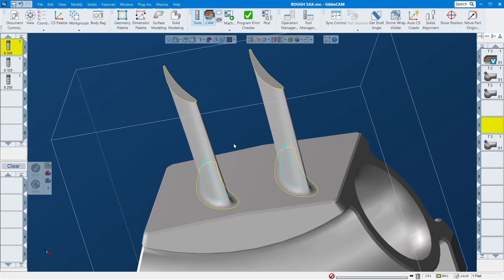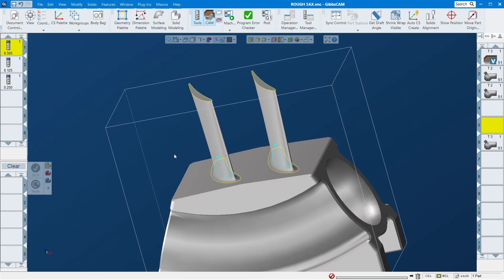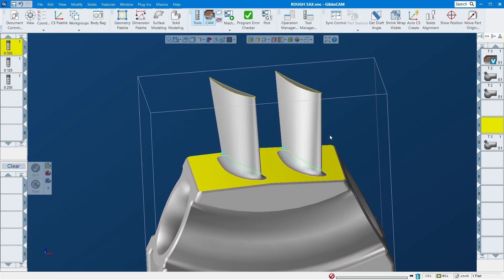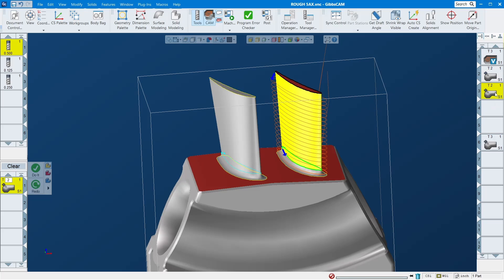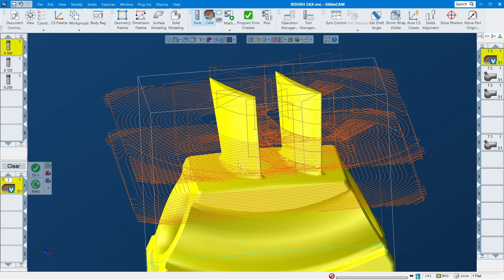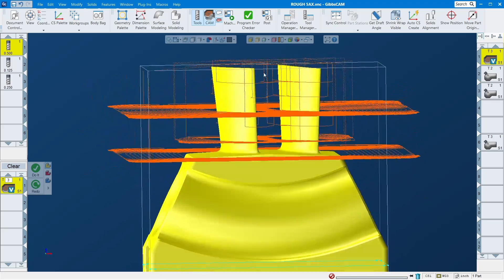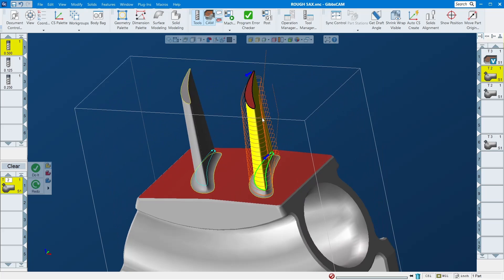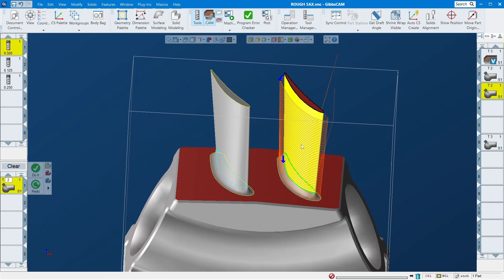For example, with a part like this, I don't usually rough all the material out with five-axis. If you want to finish a tool path and floor like this part, I rough out with three-axis toolpaths and then come back and thin it with a five-axis toolpath. So let me show you — this will be Volumill. You rough it out mostly like this, and then you come back with a semi-finish, leaving some material, and then this one will be a finishing pass.